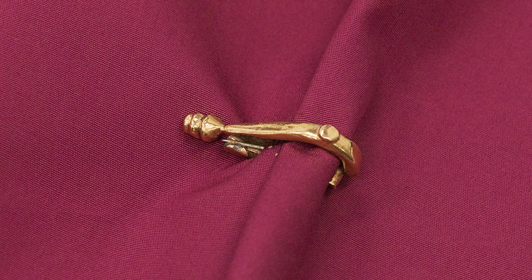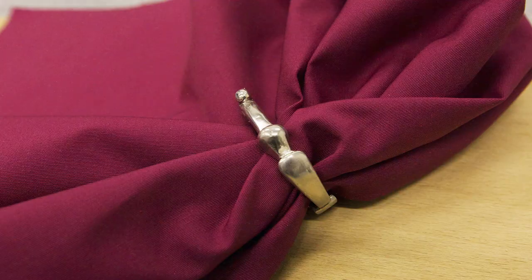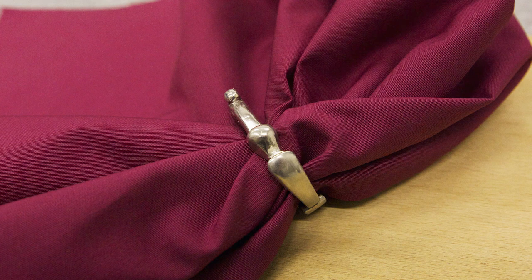In order to finish the pin, I'll be taking a small piece of bronze, hammering it out into a long thin wire with a tab on the end — just like the ones in the museum — then drilling through that, and riveting a pin that goes through the round end of the brooch. There's a tube end on it; you fit the pin in there, put a rivet through it, which holds it in place so it can swing free, and then slip into the catch where it'll hold it in place and it won't fall off your clothes.